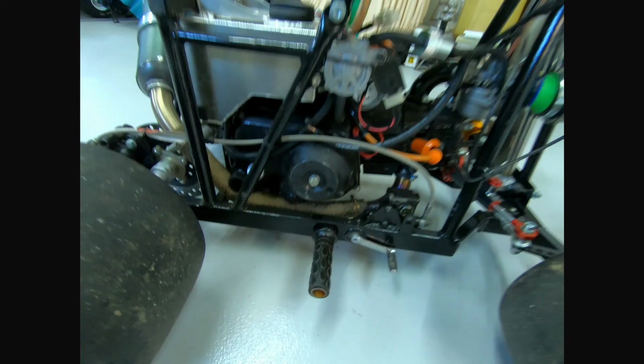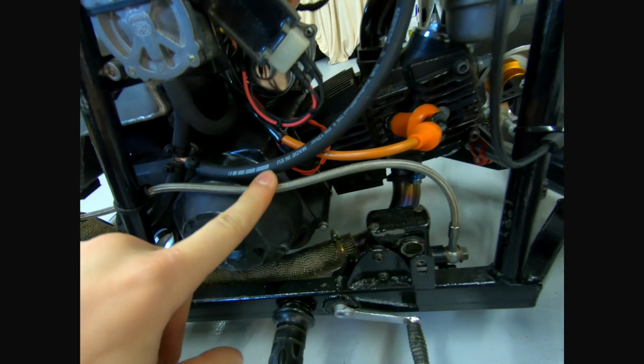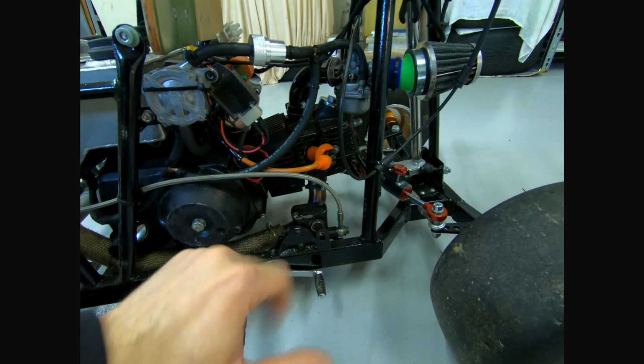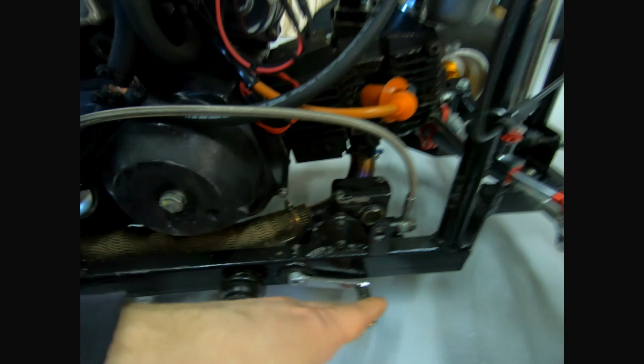Yeah, the brakes. It has a rear disc brake, only that. Stainless steel Teflon brake line. And this was actually from the quad, original brake cylinder. This was meant for a handbrake. So I chopped it off, modified it, put some threads in there, made a mount, and actually used it here as a pedal mount. This was quite an interesting problem to solve.